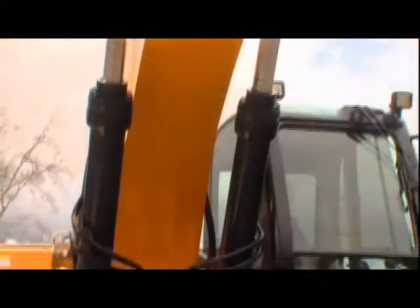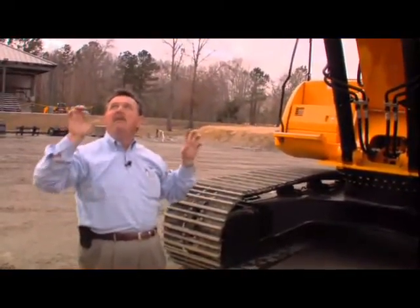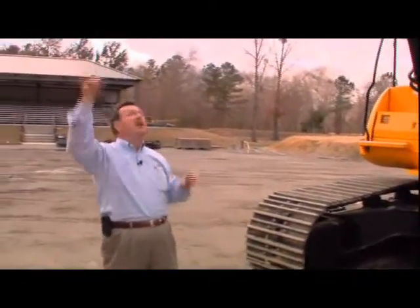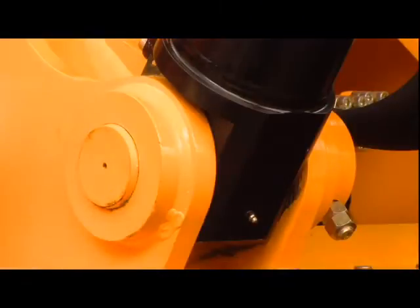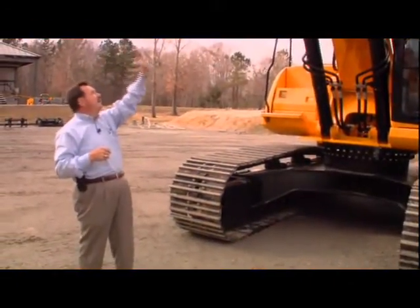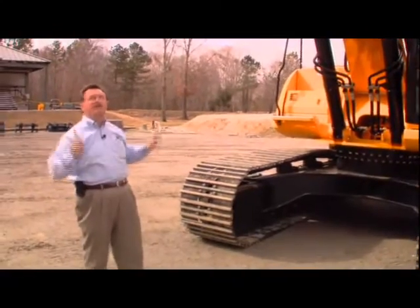I'm not an engineer, but I'll tell you this: one piece of heat-treated stress-relief steel in one piece gives you tremendous strength. That's a feature that you don't see on excavators this large, but we've put it in there. We've beefed this machine up. Tremendous strength in these pivot areas — you can see where these big bridge castings are. This machine generates a tremendous amount of power, and that's why you need structural members — boom and dipper — that can withstand the forces.